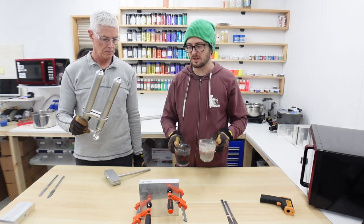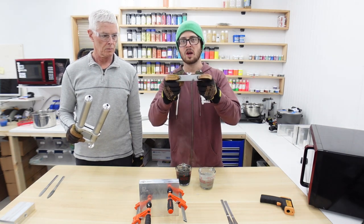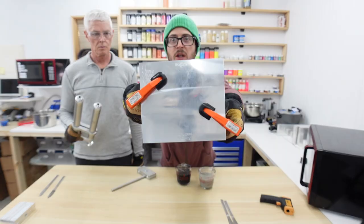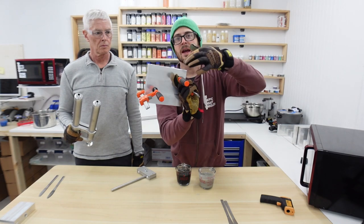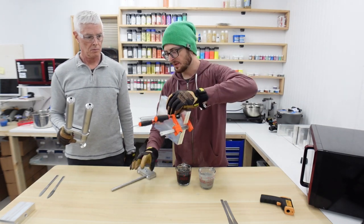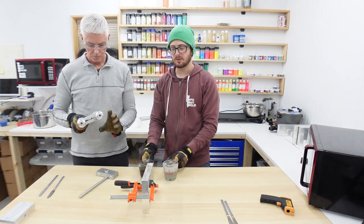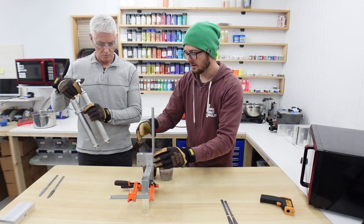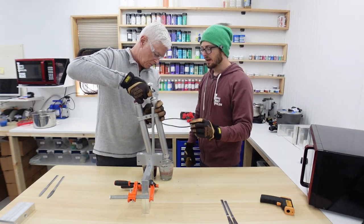Both cups are about 340 degrees. We're using a dual injector to get a top and bottom color at the same time. Two colors, dual injector, and a blending block — a mixing block that takes two ports in and puts them out the same hole. On our molds there's a label showing 'top' and 'bottom' so we know which side is which. We want black on top — lining the colors up so black is on that side — and the shark skin white on the bottom.